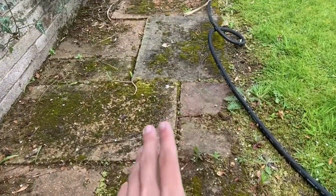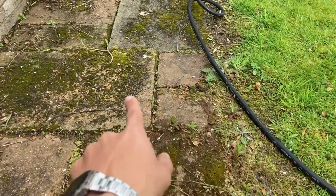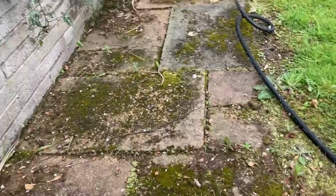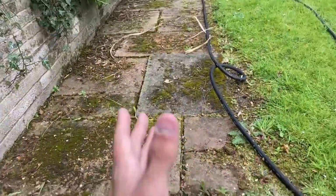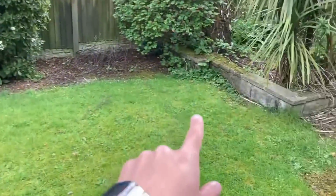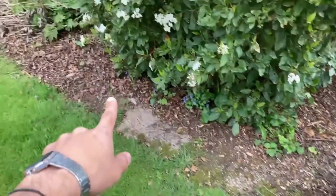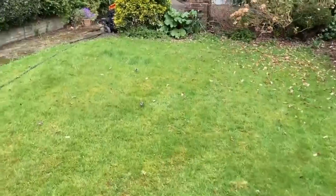So basically I'm gonna clean it the best I can, try not to break anything if I can help it. A lot of the stones are already cracked. So it's gonna be a case of just blasting all of this moss out, blasting everything out of the pointing, cleaning it up all nice. So then some guys will come in and repoint the job and get the slabs all stable again. You wouldn't believe it, but if you follow me around here, there's actually another path that goes down there, which you can barely even see. So this is gonna be a huge transformation on this job.